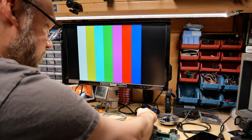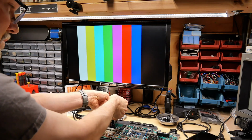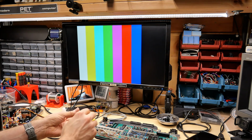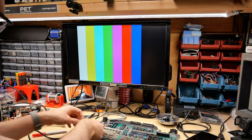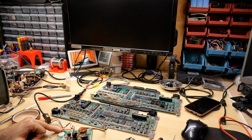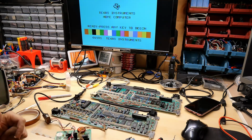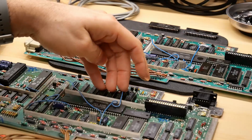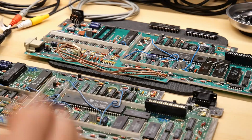Okay, so that chip is out, and I'm going to try this other one. This was the one that was included with the black screen machine. All the pins look okay on this. They're a little dark, like with oxidation or whatever, but should still work, I think. And it works as well. Double thumbs up. Okay, so for easy chips to try, that is the 3 GROMs and the sound chip. I can swap those over from this other board and test those out.